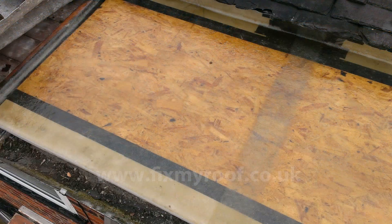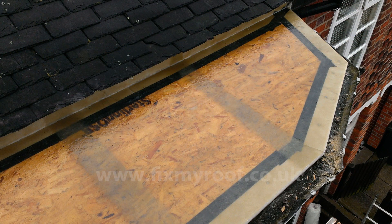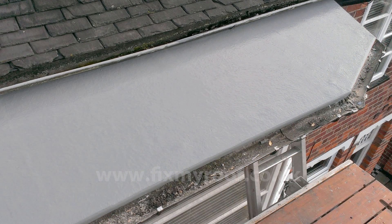Here's a close-up of the resin. You can see the CSM binder breaking down — it's the whitish patch in the middle. This is the even, bubble-free look that you require. The joints have been consolidated at this point — as you can tell, it's down very, very well. Well, that's it — another roof done here.